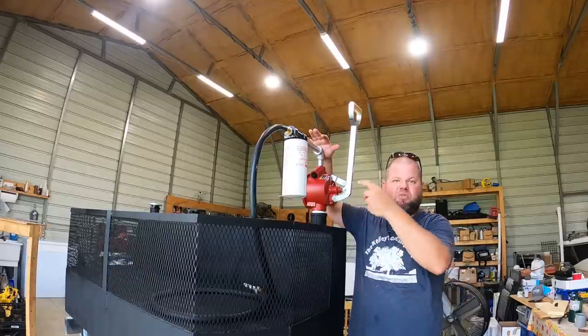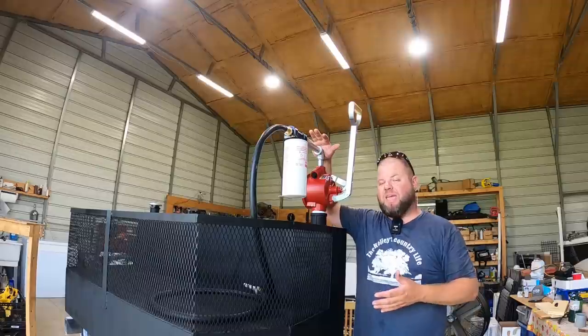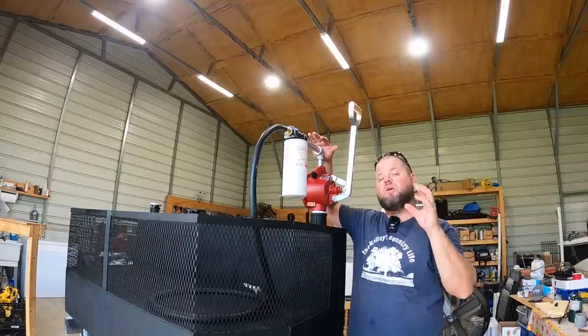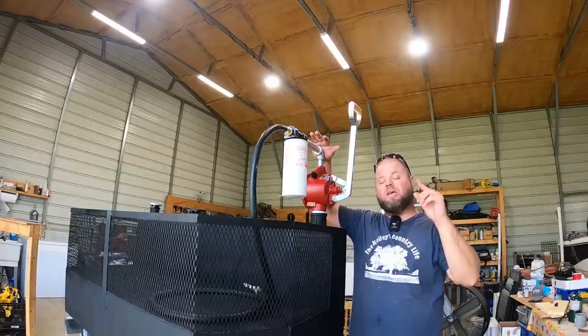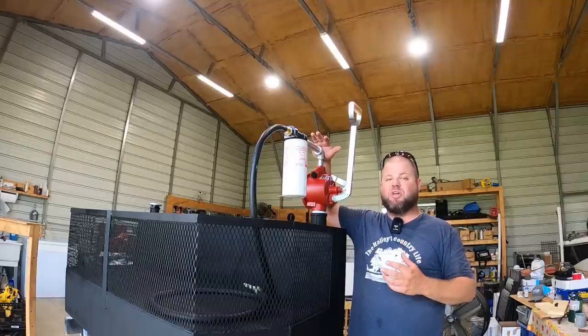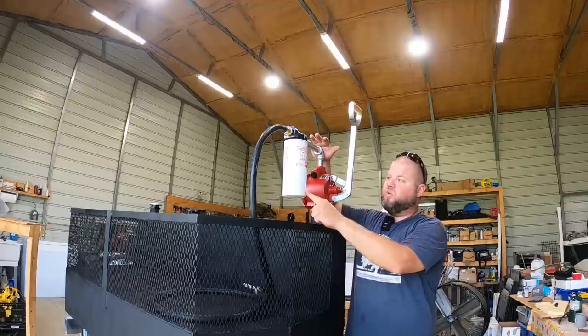It looks like flakes of floating black algae in the tank. So anytime you fill up a 5 gallon can down here, you see that stuff floating around everywhere. And I've actually had it plug up fuel lines before it gets to the filters on my system, and so has my father in his tractor. And then you have to empty the tank and clean that junk out. So I've been super excited about going to an actual filter right here.